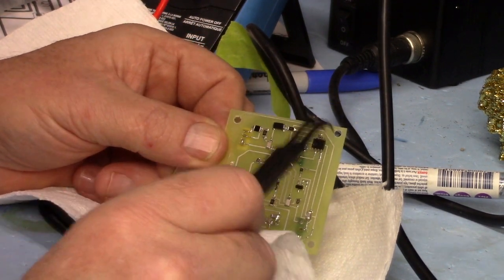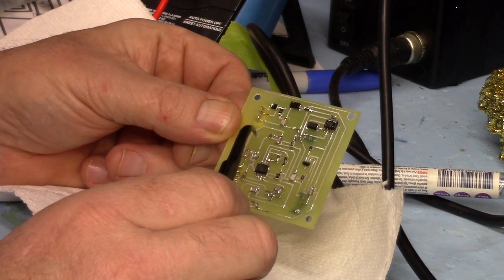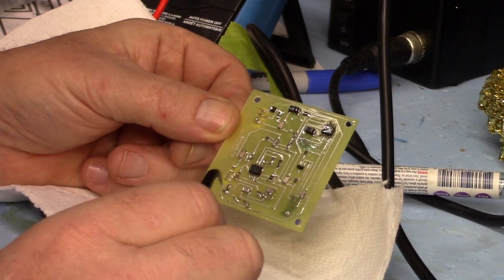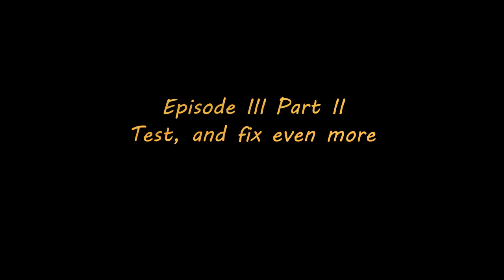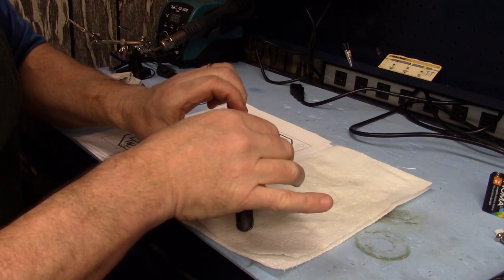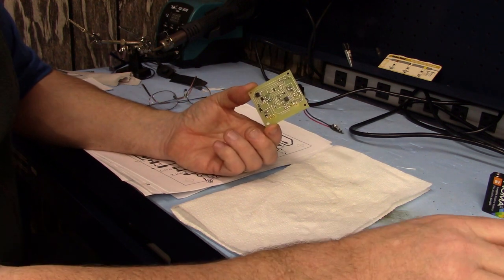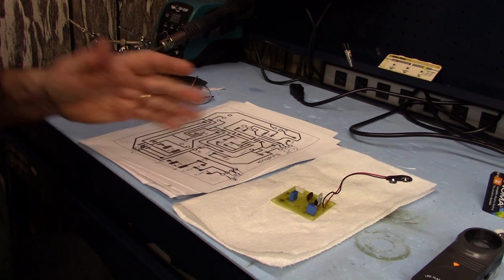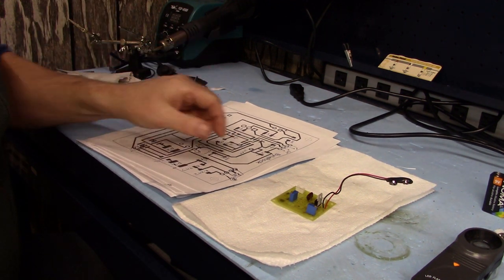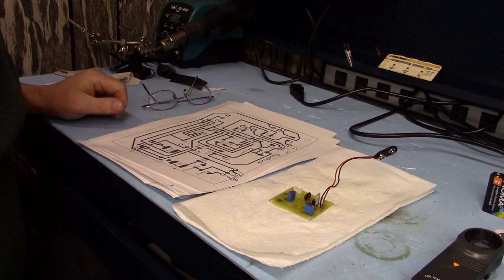I've got how many bodges here, here, here, here, here. Don't want to know. Next up, once I've got everything put together, I go through the whole board again checking it with my ohmmeter, looking at it with the loupe, going over my schematic to make sure nothing is buggered up. And then eventually, once all that is done and it's nice and clean, I'll actually go out and test it - might be another hour or two. Boring stuff.